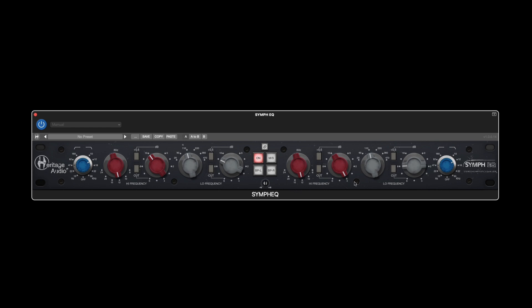Then finally apply the cut feature to reduce those bothersome frequencies. There's also a plus or minus 12 dB trim screw allowing for any level compensation that might be necessary after processing to ensure a suitable output.